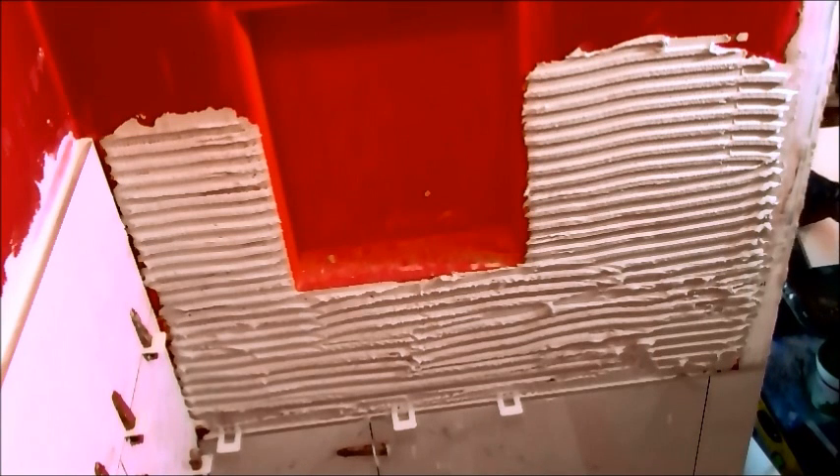There are a lot of little tile cutting tricks — maybe I'll do a dedicated video on just cutting tile someday. You don't want to waste tile going through three or four pieces trying to get one cut done; it wastes time and money. If I had known ahead of time there was a three-quarter-inch cut at the bottom of the niche, I might have ripped all the bottom tile at three-quarters of an inch so that when I got to that point it matched up perfectly — another way to avoid that small sliver cut.